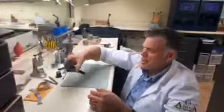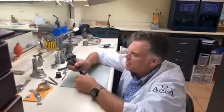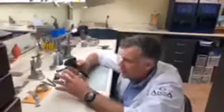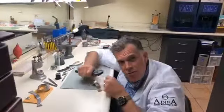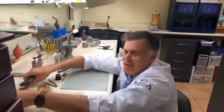Another basic tool is the back case key. These days there are a lot of bigger watches around, so we've had to go to these bigger sizes. We buy these from Bergeon in Switzerland. They go out to a really nice size so we can get into the key markings in the back case to get a nice firm undo and redo. The key to this key is not marking the back case.